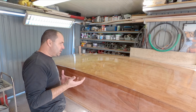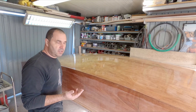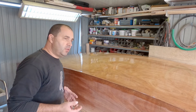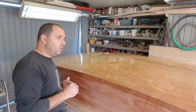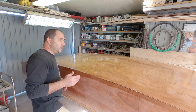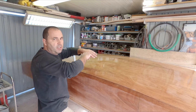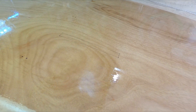Guys, I'm sorry if I didn't explain much of what I was doing in this video, but I am not too comfortable with glassing - I was trying to concentrate to see if I didn't screw up that much. But as you could see, when starting it pays off to spend a bit of time laying the cloth down properly with no wrinkles or anything. Spend some time there - that will save you a lot of trouble once you start putting the epoxy. There will be fewer bubbles and it will be a lot easier to run the squeegee. When you do that, start from the middle of the cloth towards the ends. Also I haven't opened the center case slot yet - I haven't got my router yet - so I'll just wait and open it later.